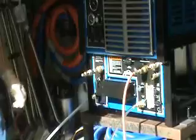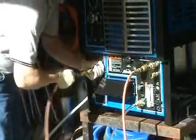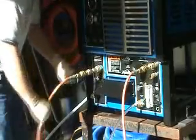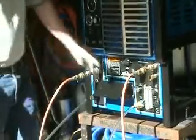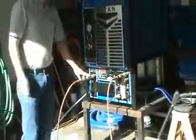We've already got our solution hose plugged in to the outlet port of our machine, and we're going to take then and connect it into the inlet port as well. So essentially, this hose is creating a loop from the chemical outlet side of the machine through the hose and back to the inlet side of the machine.